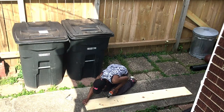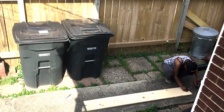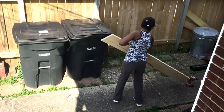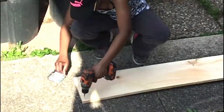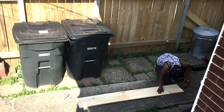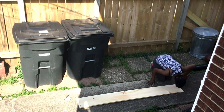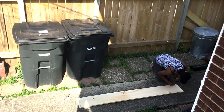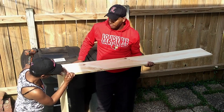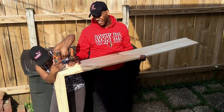For the actual bed, the dimensions are four-by-six rectangles. To put those together, I'm screwing three screws in along the edge of the six-foot plank, just until the screw reaches the other side of the board. That helps a little bit getting it through to what's going to be connected to the four-foot board. To get the two boards together, hold the six-foot board horizontal and the four-foot board vertical, line them up, make sure everything's straight, and finish those screws through into the four-foot board.